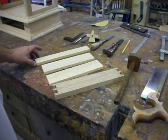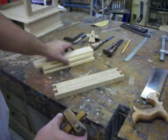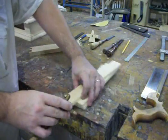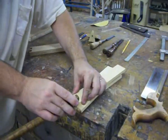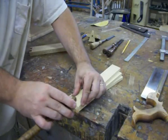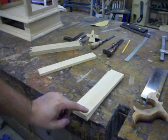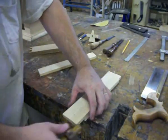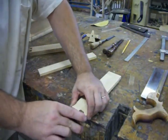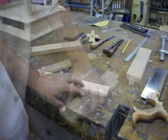Now after I've got all my pins cut in the front, I want to make my scribe line all the way around on all the rest of the boards — so this is my back and my two sides. I'm just going across two or three times, flipping the board and running it again. This marking gauge is set for the thickness of the drawer sides. Now with the back done I want to do the sides. You have to go all the way around because you want to clip off the edge grain — you have to saw down to it on a line, so you need a line there to guide you. I'm only doing the back side of this because the front side has to be a different marking gauge set.